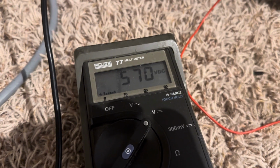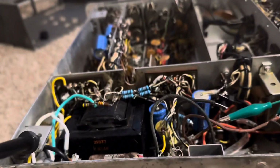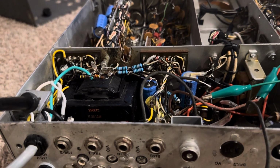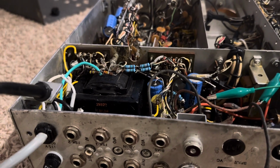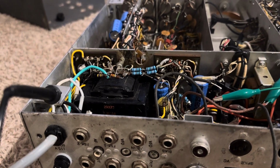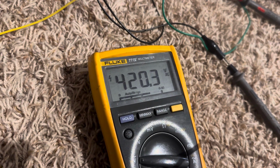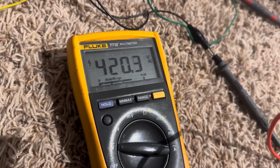So the next difficulty will be getting the 340 volts working, and for that I'm going to put a couple of transformers in right here and neglect using this transformer, which in the schematic they were using the center tap for the other DC voltage. That was, I guess, a cheap way to do it, but it would make the 340 volt supply dependent on the 600 volt supply, as they're both one supply actually. So gonna put in some new transformers when they come. A 240 volt transformer, 250 volt, that'll get me up to about 340 volts with a bridge.